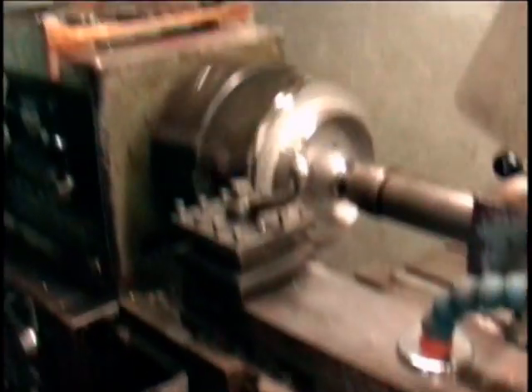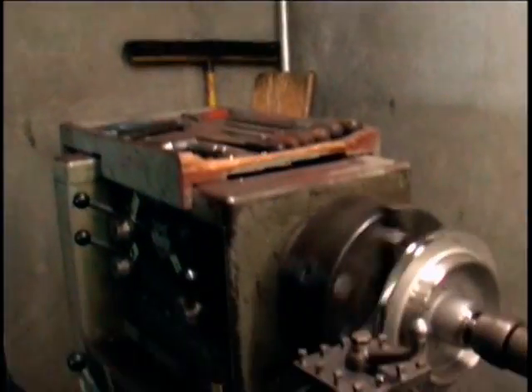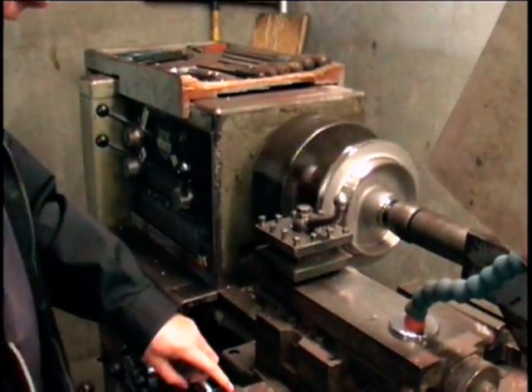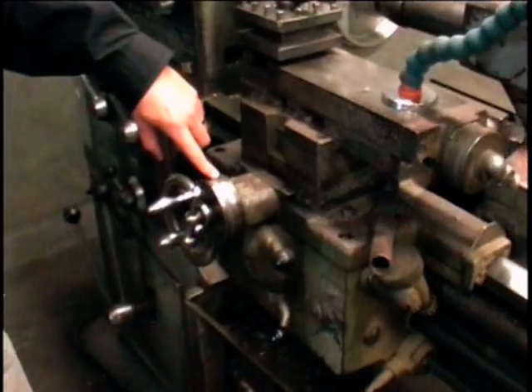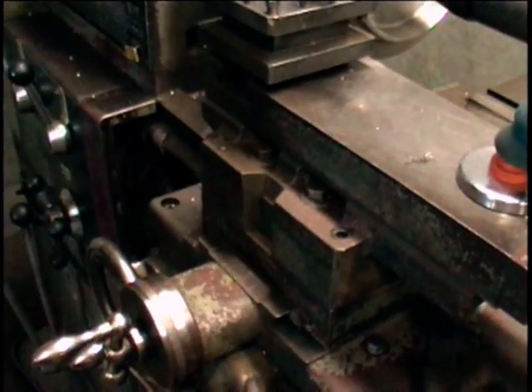With the machine starting, we'll come into position with the tool over here and put it up to the workpiece. We're really just going to touch the workpiece and then move away. So we've already touched the tool off, and we can see here that it just fell on 40, which from taking a previous cut, we know we've taken 40 thousandths of diameter off of this part.